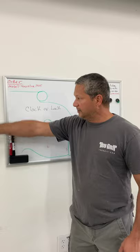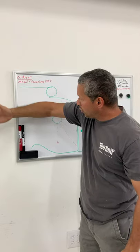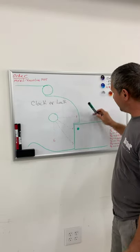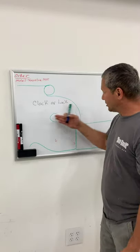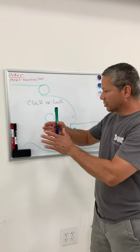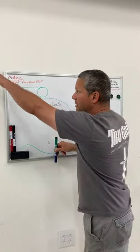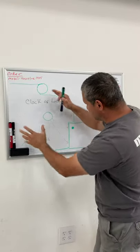Imagine here's the blade. You put downward force on the back of the blade — what's going to happen? It's going to want to rotate on the pivot, the hinge. If you have your locking bar right up at three o'clock, you're at the horizon line of the pivot. All it's going to do is kick it off, or your locking bar is going to jam up. It's going to be inconsistent. So the closer you are to the center, remember force is coming down, rotating around this hub.